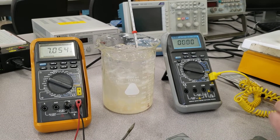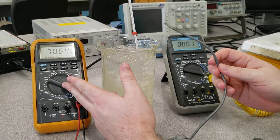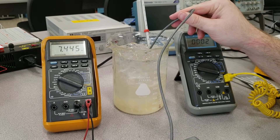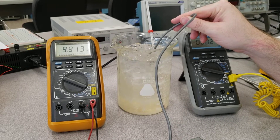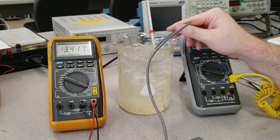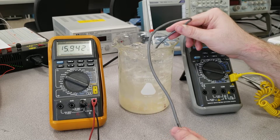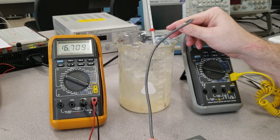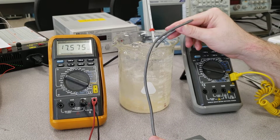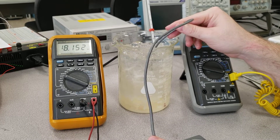The second way to take a measurement is using a thermistor. The important note about the thermistor is that it only measures resistance — you can't actually get a temperature measurement directly from this. If you plug it in, you're going to get a resistance change and wait for it to reach steady state. You then need a calibration equation to convert that resistance to a temperature. The thermistor gives you a resistance, which correlates to a temperature through a calibration equation, and you have to do that calculation yourself. We'll wait for it to slowly reach steady state.